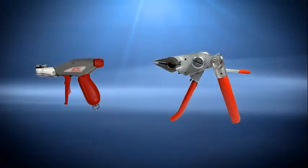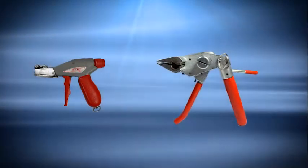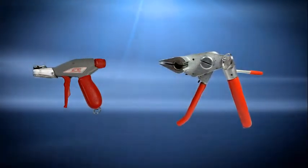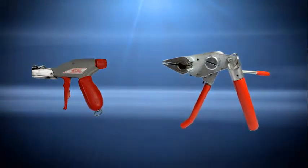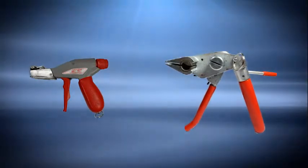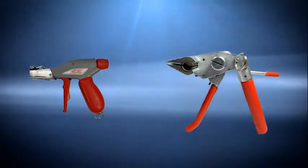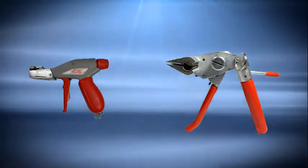What about tools to apply these products? Do you offer special ones for stainless steel? Special tooling is required for the installation of stainless steel ties to ensure that they are installed correctly and at the proper tightness. We offer the MK9 SST which will do stainless steel ties with a width of up to half an inch. For the larger sizes we also offer the CTTS S900 which will work across our entire line of stainless steel ties and do up to 900 pounds of tensile strength.